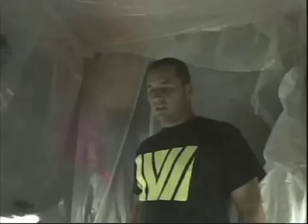We've let our last pour dry. I've turned it over — this is the final pour on the top side, the third and final pour of this side. I've smoothed down some of these edges. I'm going to wipe it down with acetone to ensure good adhesion on my last pour of resin, and then I'm going to mask the edge with tape so we don't have this kind of dribble on the last pour, so it's a little easier to sand — much the same way as we did on the very first pour.